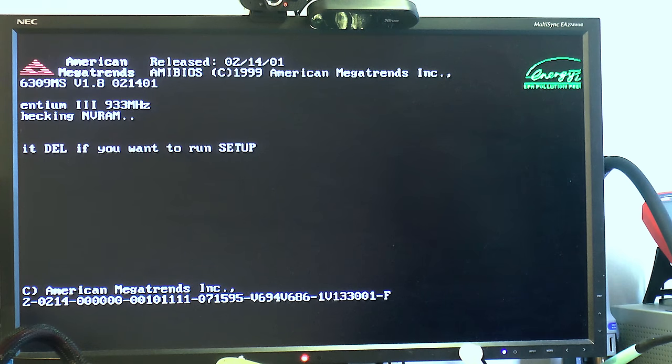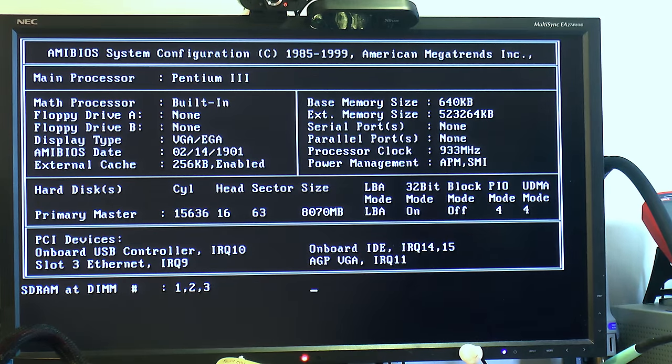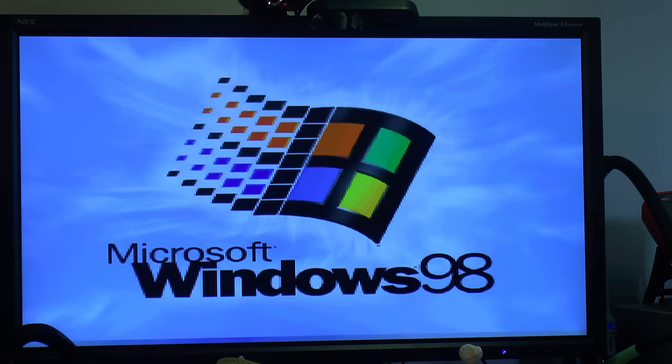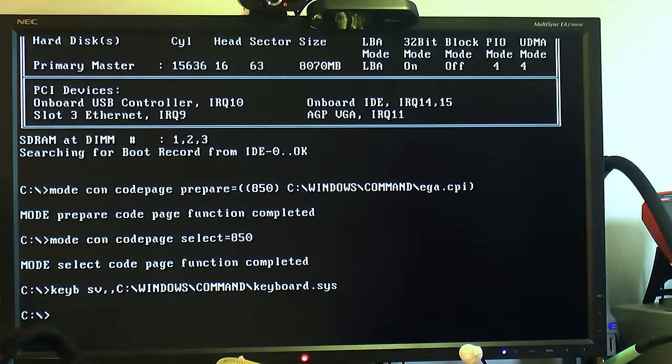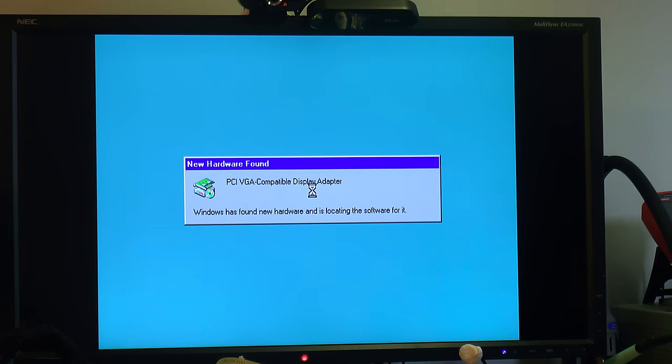It might also fix the stupid problem that I can't set the clocks from the NVIDIA control panel, and I found that to be the only really reliable way. You can't do it with RivaTuner, I think, but I have problems with that on the other card, so it could be the BIOS on that card. We're booting up here, so at least it didn't get bricked, and I have the old BIOS, so it's easy enough to flash back. And it's going to reinstall the card as soon as you change anything in the BIOS, so we swap the whole BIOS.